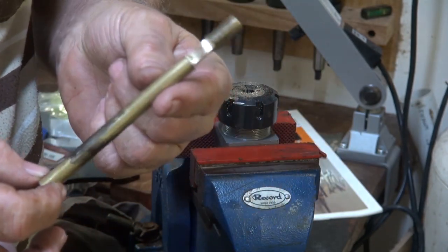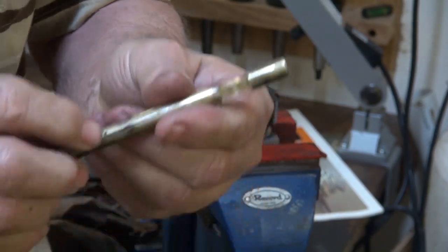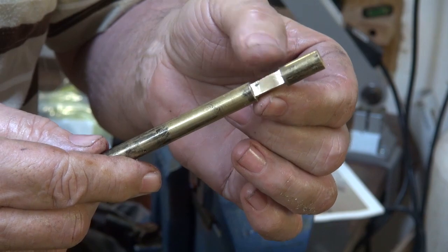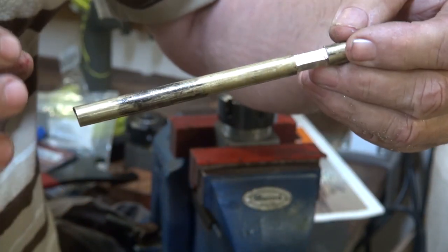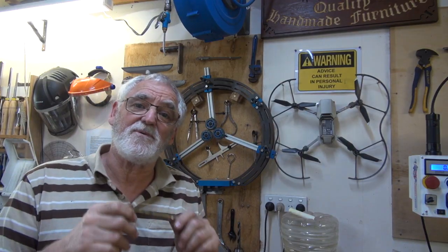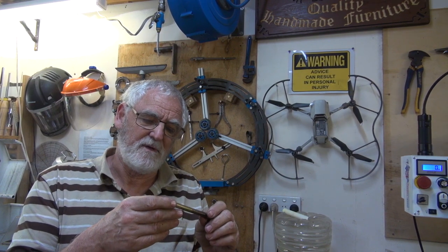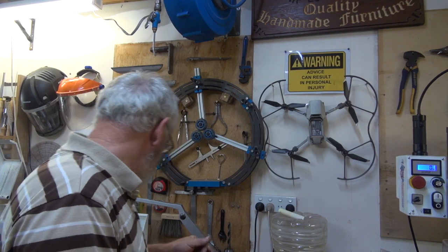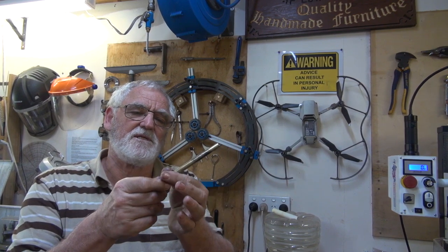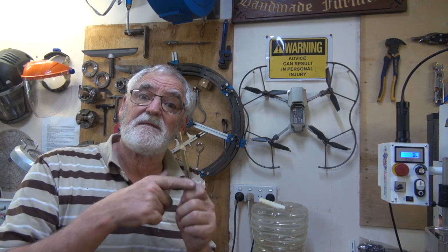There is the start of a harp tuning peg — I've got the string hole here and I've got the quarter-inch drive socket or drive pin at the top. This is held in the three-jaw chuck, and then I'll turn the taper, which I'll do in another video because at the moment I'm waiting for a stepped tailstock bit to come, as I was having problems getting right in there on the tailstock. As soon as I get that I'll turn the taper pin so you can see it, and then we're back down to the woodworking shop to see if I can fit it into the neck of one of the harps.